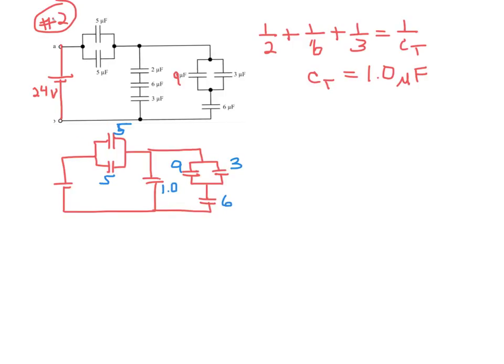So I've drawn the new diagram, and I've magically changed in midstream here one of the capacitors to 9 microfarads. This one right here, I'm going to make it a 9 just so it's a better illustration. So I brought the 9 down. Everything here in blue, and I've left the units off because I'm getting crowded. You can leave the units off of the diagrams, but these are all microfarads. So bottom line now, I've replaced the 3 capacitors right here with this 1 microfarad capacitor.